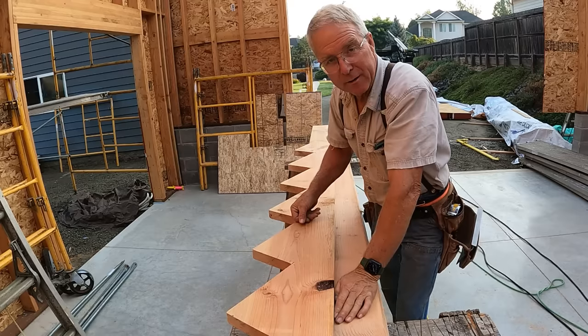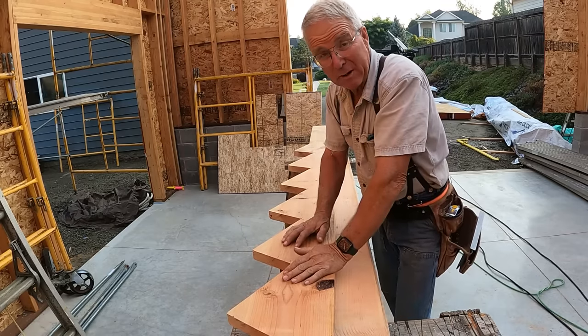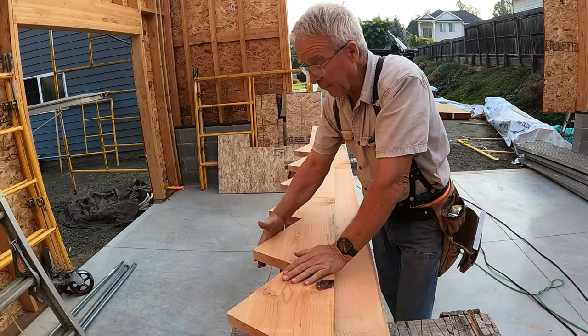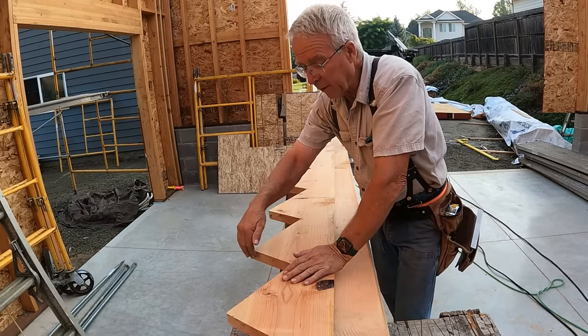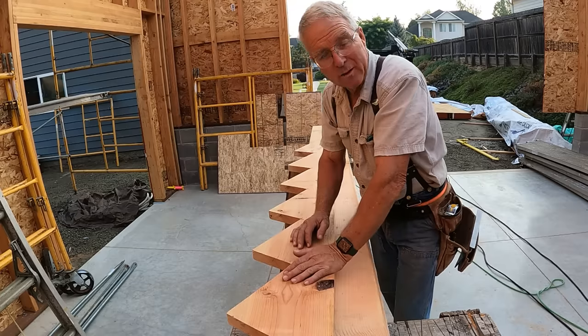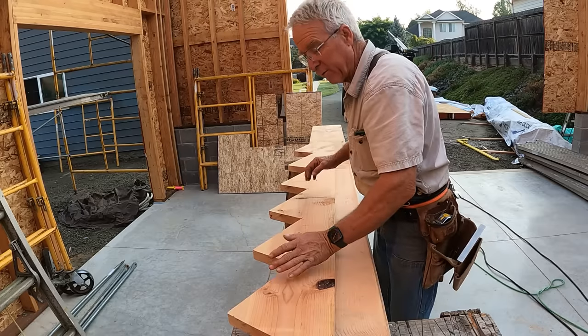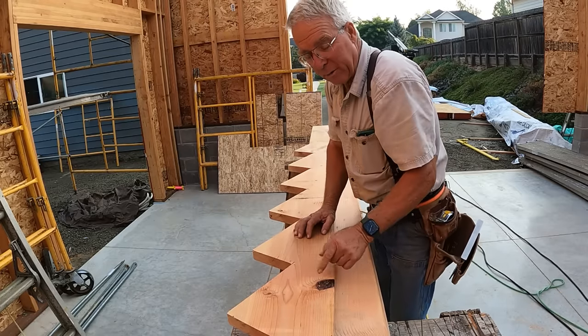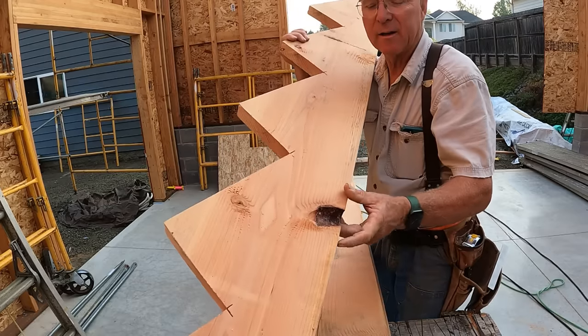The first defect that I want to show you is in my pattern. This is the piece that's cut pretty darn nice. When I put a level on here, it's level. When I put a level on the front, it's plumb. That's what you want. Not only that, but I'm going to have a nice even rise from the bottom riser all the way to the top. But you see that knot? Can you see that knot? Of course you can see that knot.